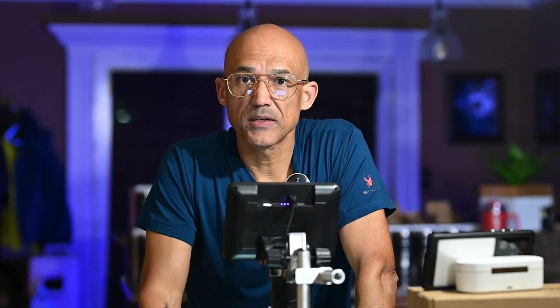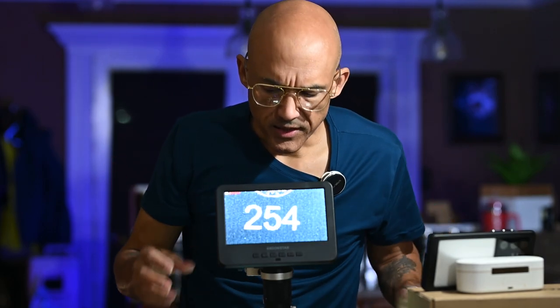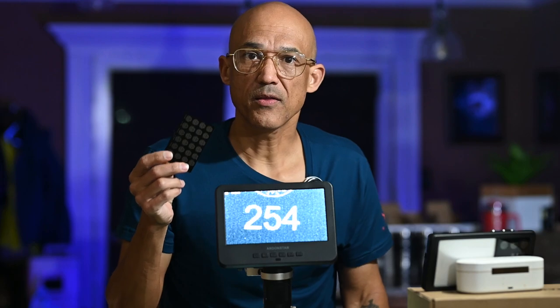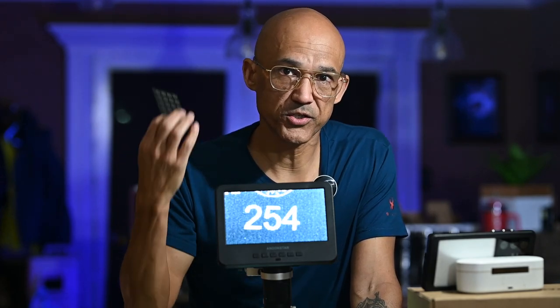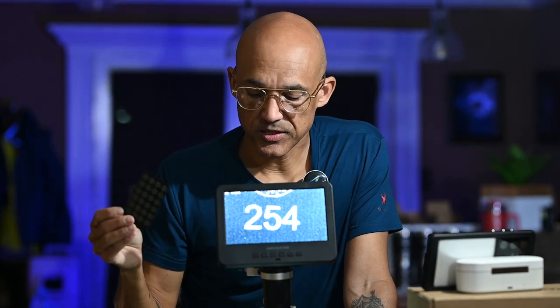It's so important to do test cards. These settings I've figured out are great for metal business cards, but they aren't necessarily transferable. This gives me knowledge of how fine my laser can get with the current lens. Obviously, defocusing by a millimeter will change the dot size and change everything. What works on a metal business card isn't necessarily going to work on a tumbler. These metal business cards are aluminum with very thin black paint — the laser's conical shape doesn't make a huge impact on such a thin surface.